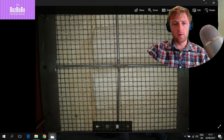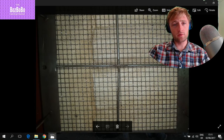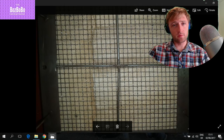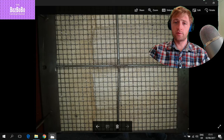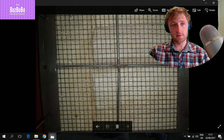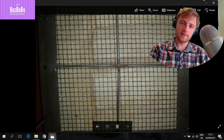Check it, and be careful when you open these inspection doors — maybe fumes will come out. The water inside the gasket, as we know, is close to 80–90 degrees, close to the boiling point, and it also contains chemicals. This water with chemicals — wear glasses, protective equipment, and safety first. Thank you for watching guys, stay tuned to Adventure Story.